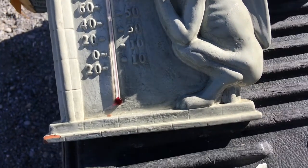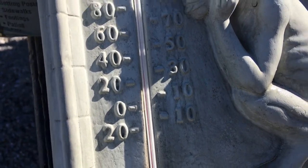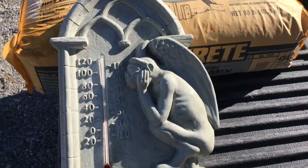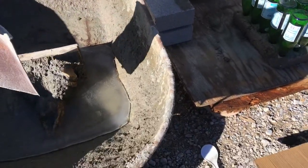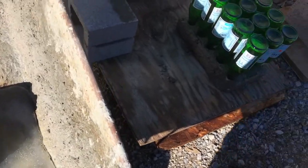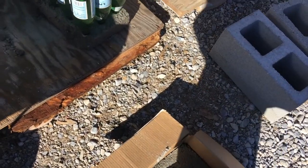Last night it got down to about 25 degrees Fahrenheit — at least this thermometer is not really perfect, but today we're talking about concrete: mixing it up when it gets too cold, under freezing. What happens if you mix concrete and then at night it freezes? Like right here — last night, like I said, it got to 25 degrees. It froze. If you mix concrete in that situation where it's too cold, the integrity is going to be compromised.